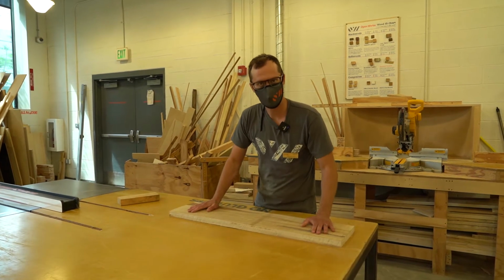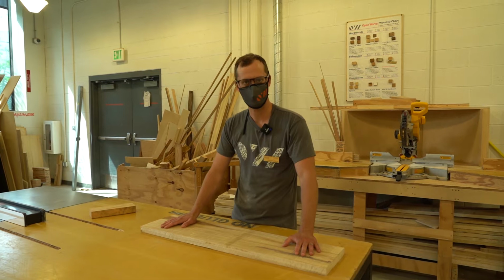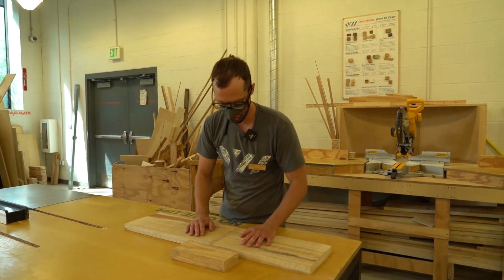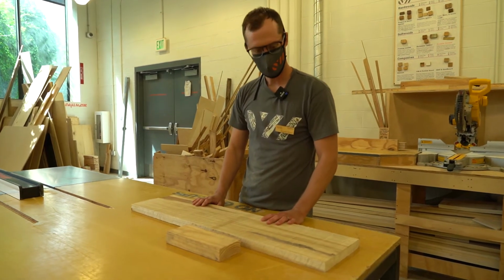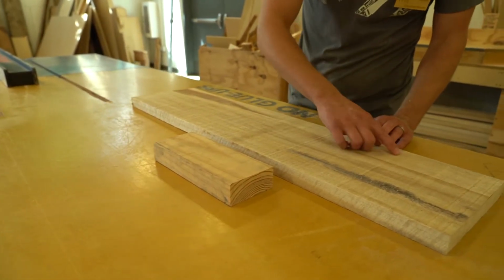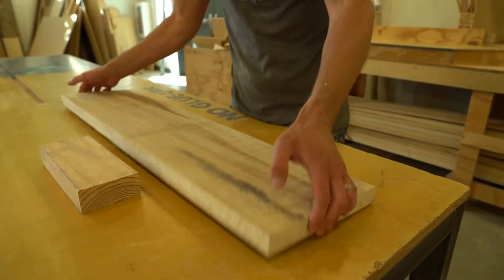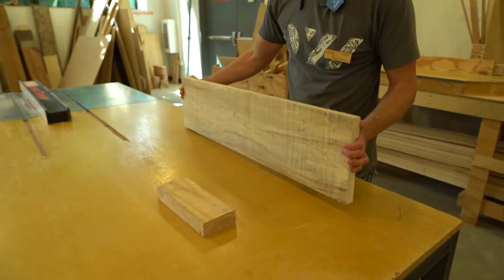This is a piece of raw lumber from a sawmill. This is poplar. As you can see, in contrast to our store-bought 2x4, the surface is very rough. The sides look roughly parallel to one another, but not exactly. And the board itself has all these saw blade marks on it. These vertical stripes are from when this went through a great big milling machine to cut it into this plank.